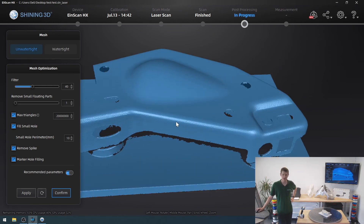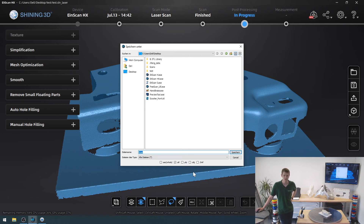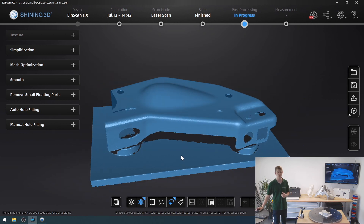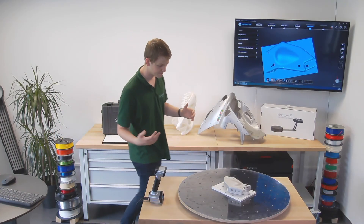Our mesh is done. This is now our model that we can work with, and I'm going to save it as an STL file so I can import it later into a third-party software such as VeriSurf. Shining 3D allows you to choose different formats — I'm going to choose STL. You can see that the meshing took quite a long time, once again due to the very high resolution I chose. It is important to reiterate: accuracy does not equal resolution, and resolution does not equal accuracy. The accuracy of the scanner is always the same. The only thing I change is the distance of points within the point cloud, making my model more detailed — but the accuracy stays the same.